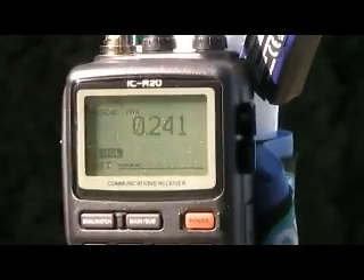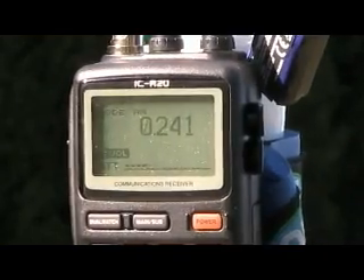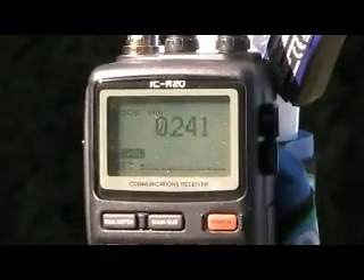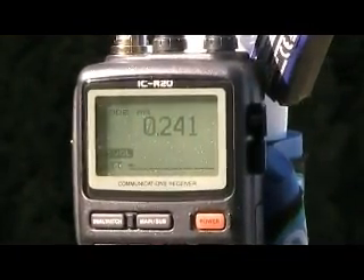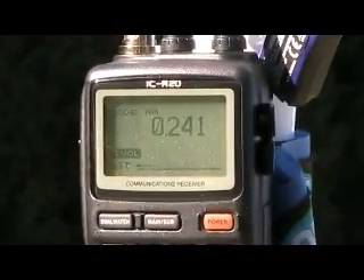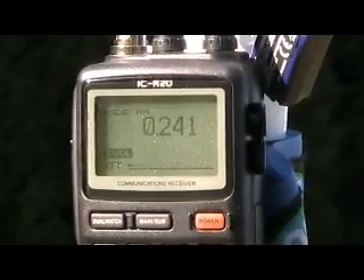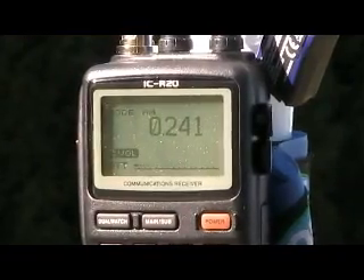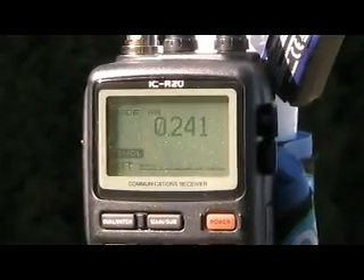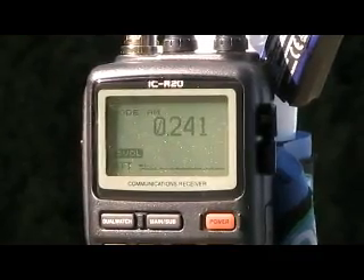Let's take the entire ground connection off the receiver. Very low S-meter reading and entirely useless because of serious modulation buzz on the signal. So the conductors and the ground below the receiver are vitally important to its performance.